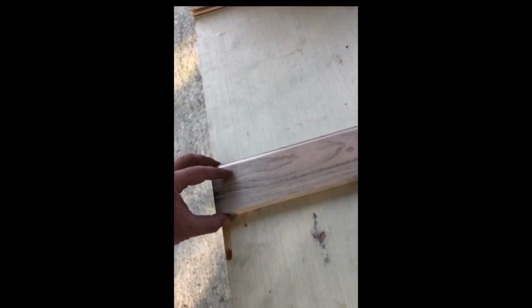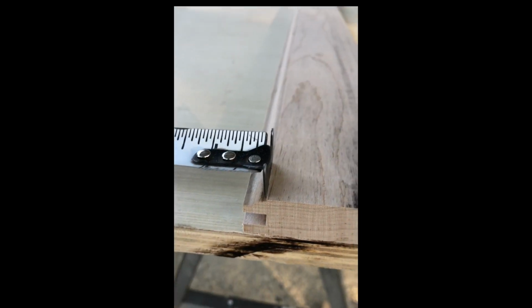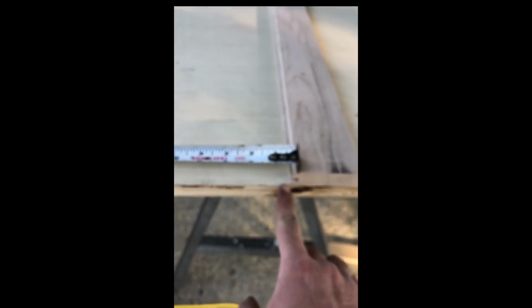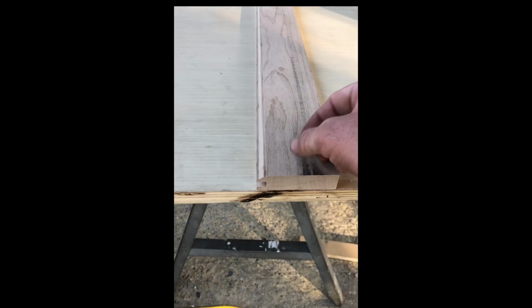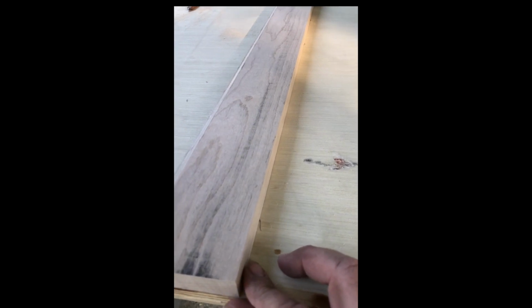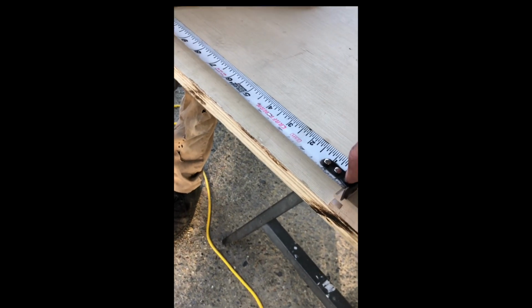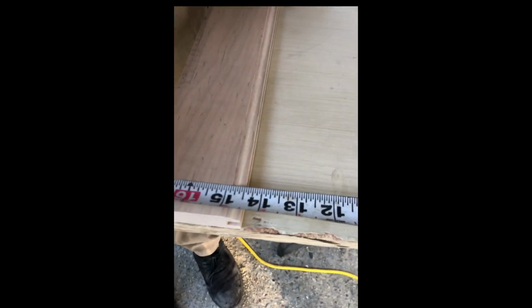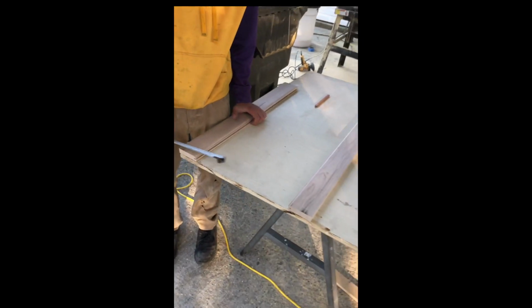Come soft. Okay. Now I'm gonna hold this down, and we're gonna measure from this little lip, because this lip also is the same as this, and that'll give us our middle piece. You would think that you have to measure to here, but you don't, because we're gonna show y'all how the little cuts are. You're actually gonna measure to this lip. So let's check my mark, guys. Right there on my arrow. I'm gonna hold this down. Coco's good on his edge. So we're gonna hold him here, right there. And that is going to be 14, and we're gonna call that 7/8. So now Coco is gonna cut us 4 pieces at 14 and 7/8.